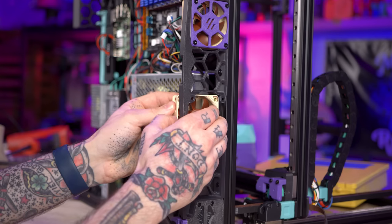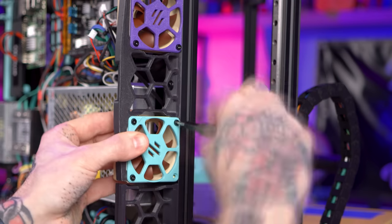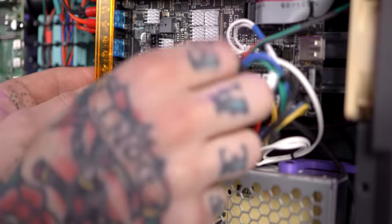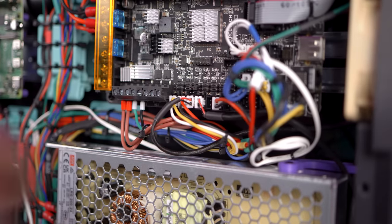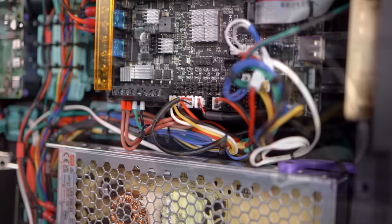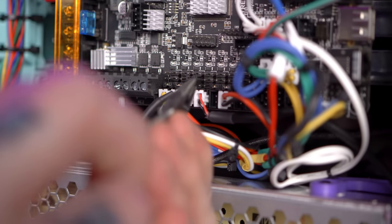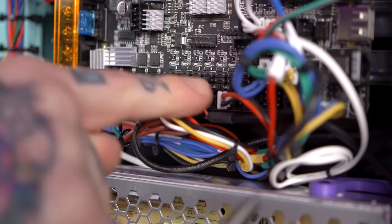Installation of this fan is very straightforward — it just slips into the skirt area. There's a grill that goes on with a couple of recesses to match the skirt. I just need to snake the wire into place and plug it into a fan port. The Voron diagram has you splice the two fans together, but as I'm running an Octopus Pro board with plenty of fan connectors, I don't need to do that. With this board I can use 5V, 12V, or 24V fans — I just need to set the jumper appropriately. Middle position gives me 12V for this Noctua fan.